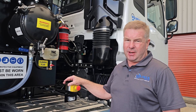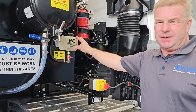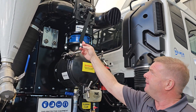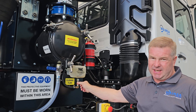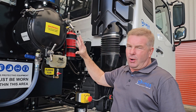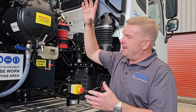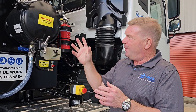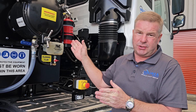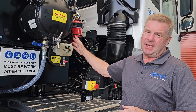I'm going to talk about the maintenance for the diesel flush of the vacuum pump. This little canister here has got diesel in it, and we use it for flushing and moisturising the inside and tunnels of the vacuum pump. When we shut down at the end of the day we always want to do a diesel flush. We're going to have the vacuum pump running and in vacuum, and we're going to open this here for two seconds only — one, two, turn off. We then release that back to neutral. What that's done is put a film of diesel through the vacuum pump. Sometimes when we are sucking clay type material we get moisture through the pump with a bit of clay in it. When the vacuum pump stops it's hot and sometimes that can bind up to the point where the vacuum pump won't start the next morning — the hydraulics won't turn it over because it's glued together with that moisture and residue. By doing the diesel flush we eliminate that and keep it nice and fluid.